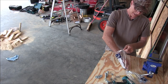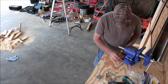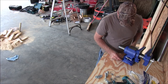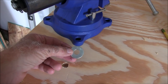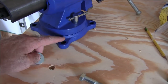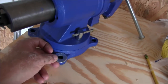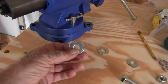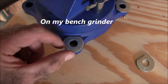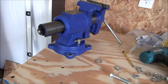For the top I found some washers, but I'm not sure they'll fit — they might not. There's not enough room because the washer is a little bit big and it's hitting right in the corner, so I'm going to have to put a little flat spot on it so it'll go all the way over and I can put my bolt through there. What I did was I got my washer and I put a little flat in it — you can see it right there. So it'll go on there and still be able to go through the hole. I essentially just made a little extra room for it.